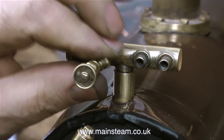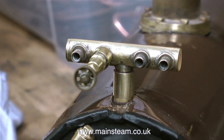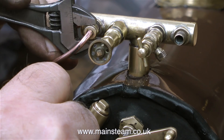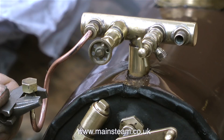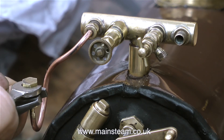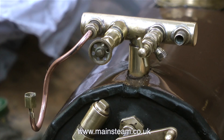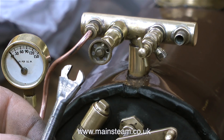So now it's time to fit the rest of the boiler fittings, starting with the injector steam valve. To save time, I'm not going to show the application of the Loctite 542 — just take it as read that any of the valve fittings are fitted to the manifold using Loctite 542 as a sealant. On screen at the moment I'm fitting the pressure gauge siphon, and as you can see one end of this siphon is blocked up with a blanking plug left over from the hydraulic test done on the boiler before I commenced the rebuild. Now I've removed the blanking plug, it's time to fit the pressure gauge. I'm not sure about this pressure gauge because it was reading 30 PSI just sat on the bench, so I took it apart and readjusted the mechanism — but I think maybe a new one's in order. I'll fit it for the time being to show how I fit it.